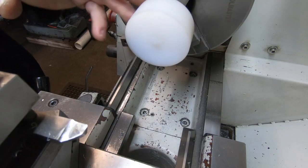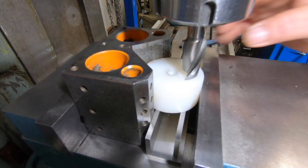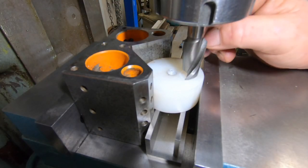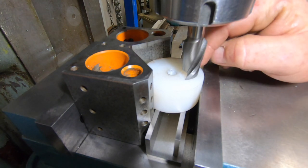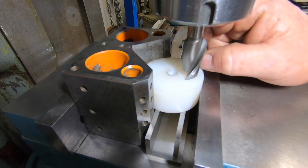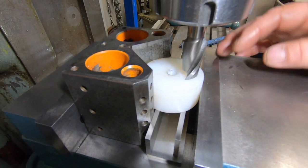I might put the holes in for the magnets very last. We've got a three-quarter end mill up — this is where we're going to make the pockets for the magnets. I'm going to take this very, very slowly; I don't want it to grab and rip it out, screw everything up. Let's hope that doesn't happen.